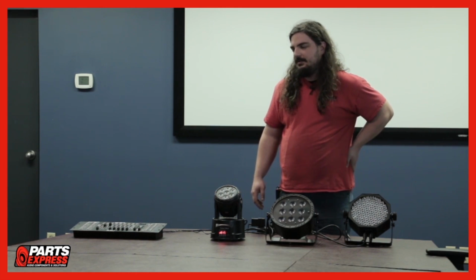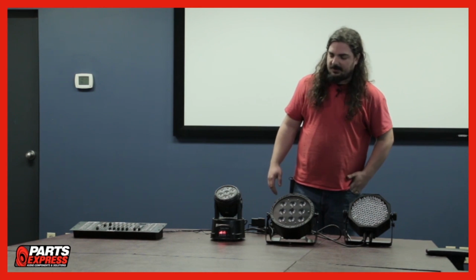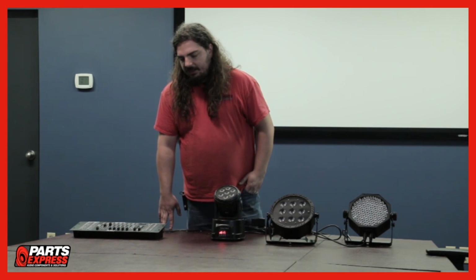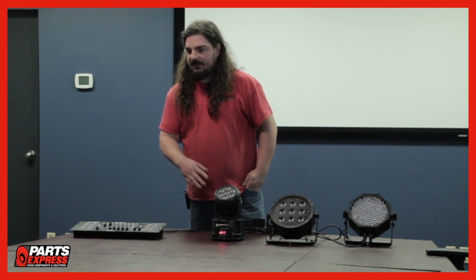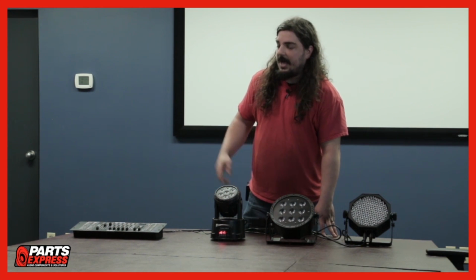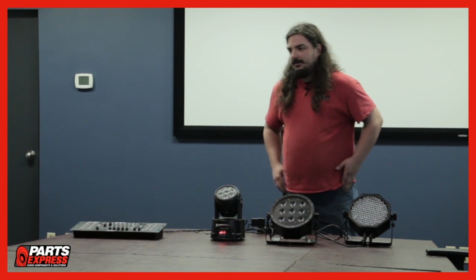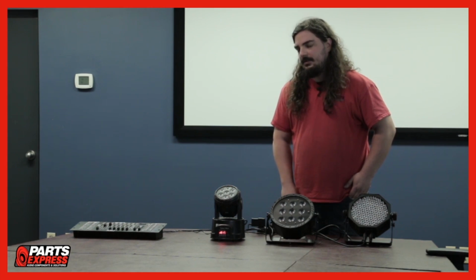I got all six on different programs. Okay, gotcha, so differently addressed. Yeah, they all do something different. Hmm. The only thing I can think of is if there's something specifically wrong with that one light, if the power's good and the DMX is good and it's all DMX cabling and not excessively long runs. Sounds like you only have six, right? Yeah, I got six for the cars. Okay, how many lights are total running on this system? I got eight spots and six car lights. Okay.